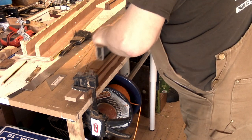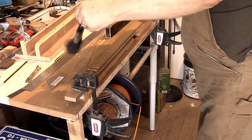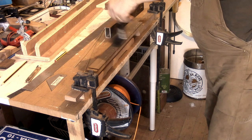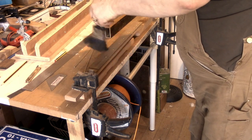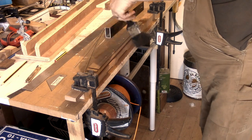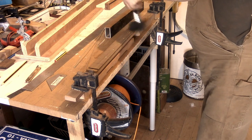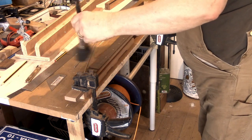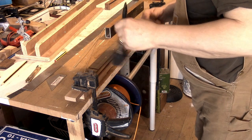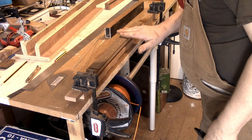By the way, this is a piece of blackwood tech, which is actually New Zealand pine that's dyed, compressed, and pressure and heat treated — it ends up very much like rosewood. It's a little bit more brittle and can splinter, so you need to be careful. If you're using something like sapele or walnut they're much softer and a bit more forgiving to work with. Maple is nice but it will discolour very easily — you need to work very cleanly with that, because any glue splodges will show.